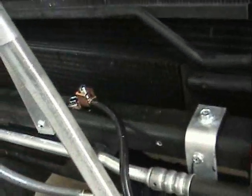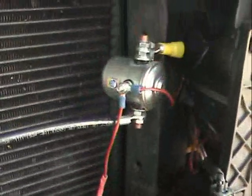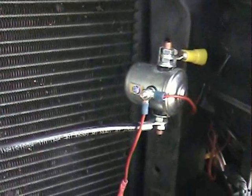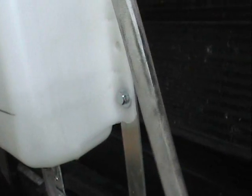I've gone ahead and straightened my wiring out a little bit, shortened up this negative lead. And I've put a nice wiring in for the pump so that it comes on when the cell comes on, off my solenoid here. Now I have also changed my electrolyte solution. I was at three quarters of a teaspoon in a gallon of water; I've gone down to half a teaspoon in a gallon of water. I wanted to try to get my amps under control a little bit better. I know this is going to reduce my production, but I just want to play with that mixture for a while and see what it gets me.